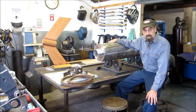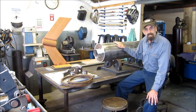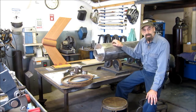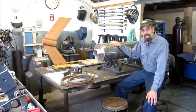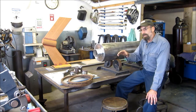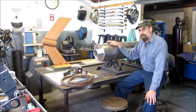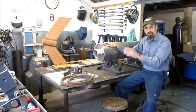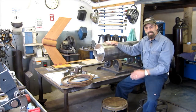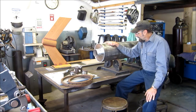I just have them set here to show you that they are a very useful tool and I spun the mast on these. As I worked it every step of the way, you do a little weld here and roll it. I'd have indicators out on the mast and that's how I was able to maintain the trueness of my mast.